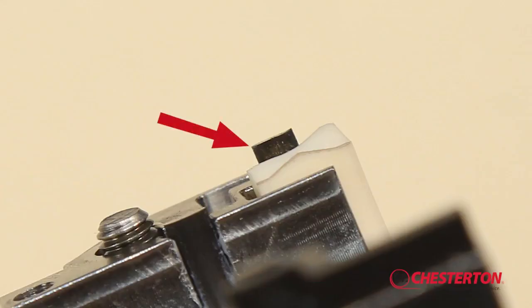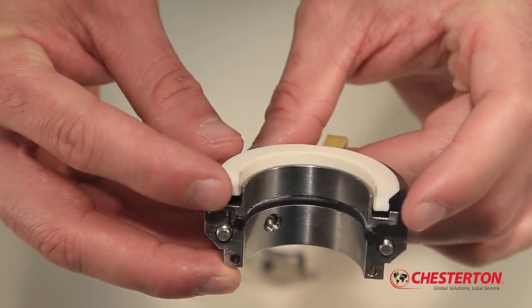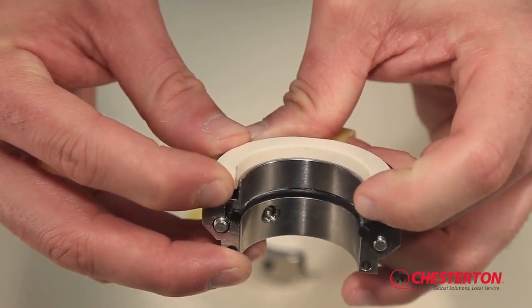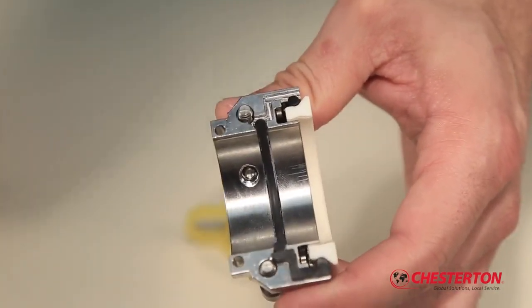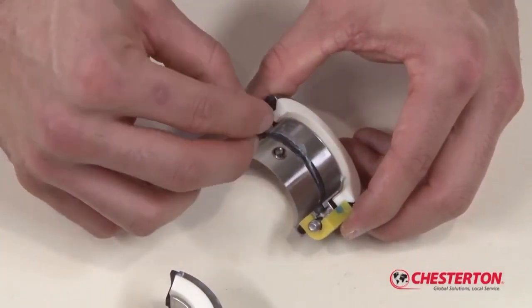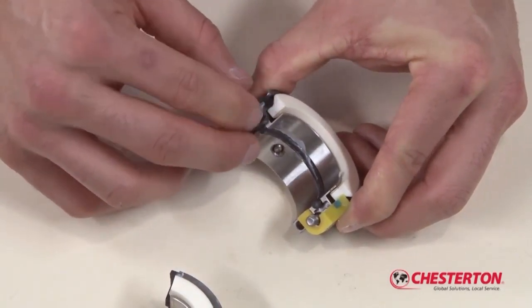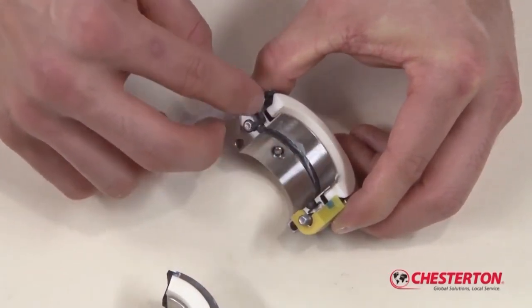If the O-ring ends are proud of the rotary face splits, gently push the ends with your finger or thumb until flush with the face. Be careful not to push the O-ring ends further into the assembly past the rotary face splits. Apply a thin film of grease on the holder assembly gaskets and install. Ensure that they seat fully into the grooves.